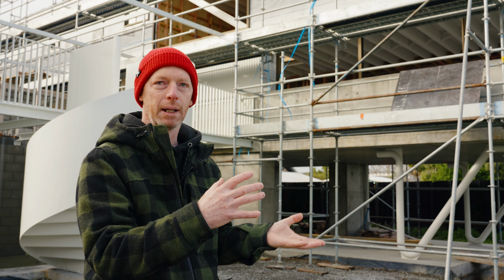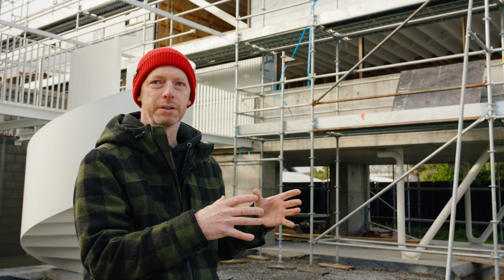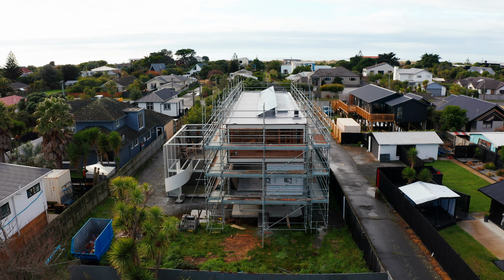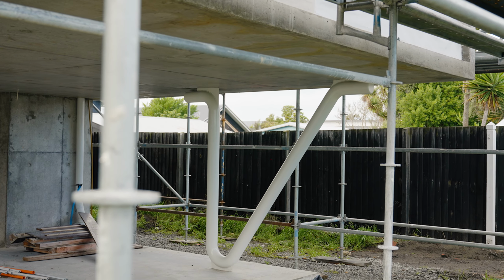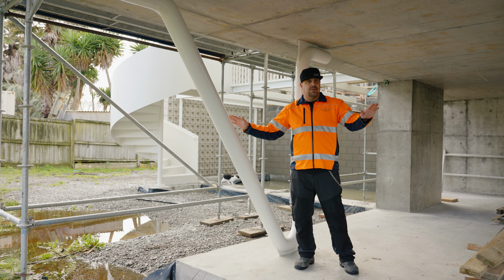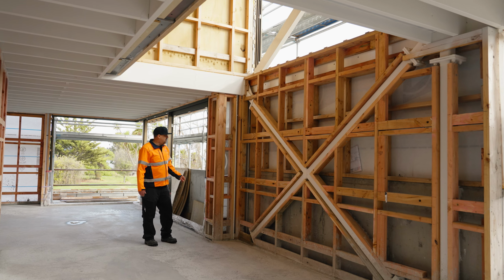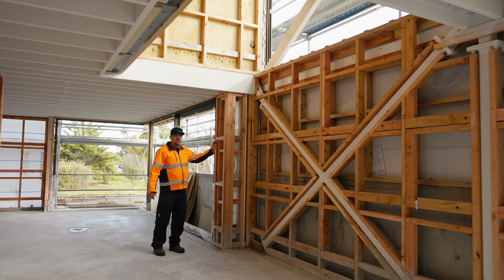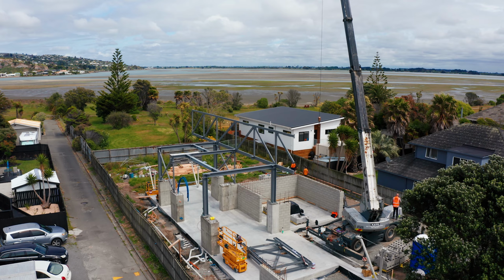And it's all evenly balanced, so it's got a 6-metre cantilever both ways, sitting on the large UC columns, then into concrete columns. We're standing next to what's holding up some of the cantilevering sections. These are spaced out to this side, one that side, with multiple straight ones at the back. So right now we're standing next to one of the first floor portals that goes down and sits on our in situ concrete columns on the ground floor.